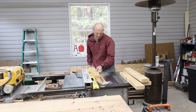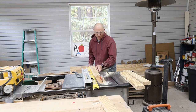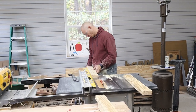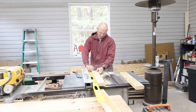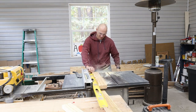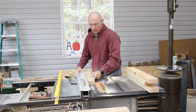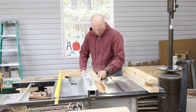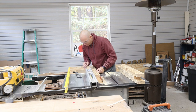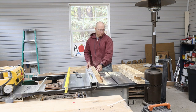We'll get them all squared up. I've got that side flat and this side is still the factory edge. I just lay it on my fence, move it over until it takes off — basically the blade width is what I'm taking off. It's going to wind up making these boards three and a quarter inches wide, so I'm basically taking a quarter inch off of the board.